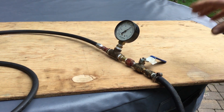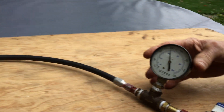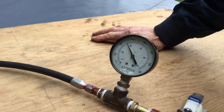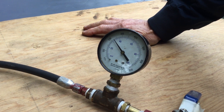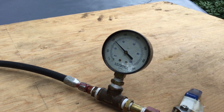They say about eight pounds, about a pound per minute. Now it is disconnected and we see the gauge going down too rapidly — it should be about a pound per minute, as they say in the book. So that was my problem.